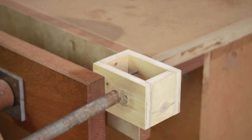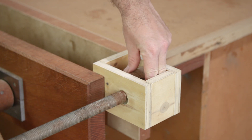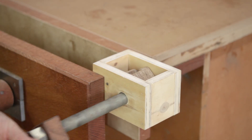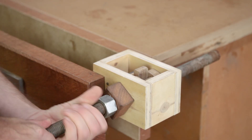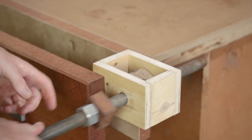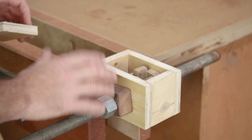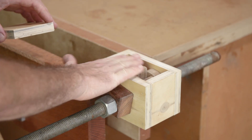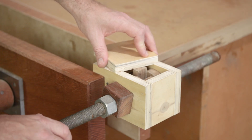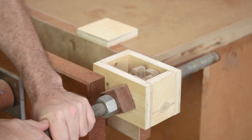I'll just show you how it works putting it together. You just hang the half nut side down and put the tab against the bar, then locate the half pipe so it lines up with the hole — and there we go. It tightens up, it really does work fantastic. Don't pay any attention to the threaded rod running on the plywood because as I said earlier it will run in bushings — this is just a demo. Before you install it on the vice, make sure everything works as it should and that the mechanism is free inside the housing. One thing I need to do here — if you imagine this is the underneath of the workbench top, that tab is very close and could get caught and wedged, so I'm going to sand a little bit off there. Just have a look and make sure everything works the way it should.